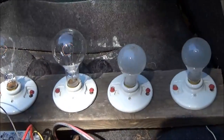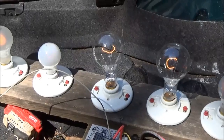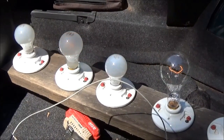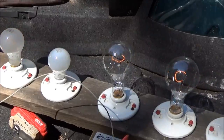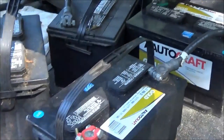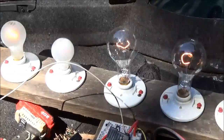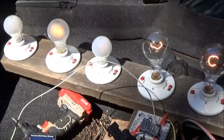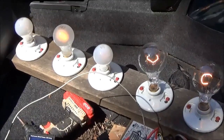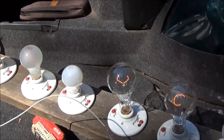This is fun — this is my first diversion load project using hydroelectric, because most of the time I'm messing with solar and I don't need a divert load. The battery bank is full but the power has got to go somewhere, so we're throwing it over to the light bulbs. You could do this with DC water elements, inverters, motors, and things, but this was the simplest way to do some testing.